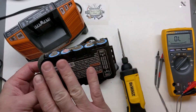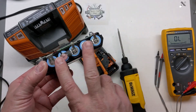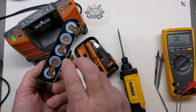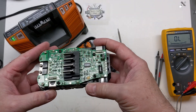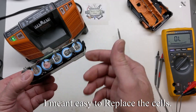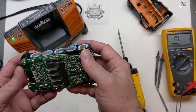The way they did their main carriage — it's part of the main body of the battery pack itself — is pretty cool. Also, these lower capacity packs are super easy to pop the cells in and out of, and either spot weld or carefully solder back, however you choose to do so. It's really easy to repair the cells on these. Of course, higher density or higher capacity packs complicate things, but it's still fairly easy on those as well.